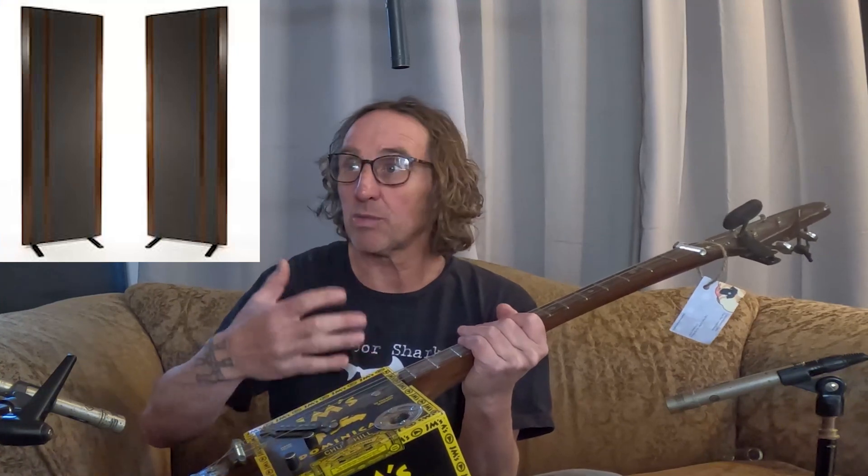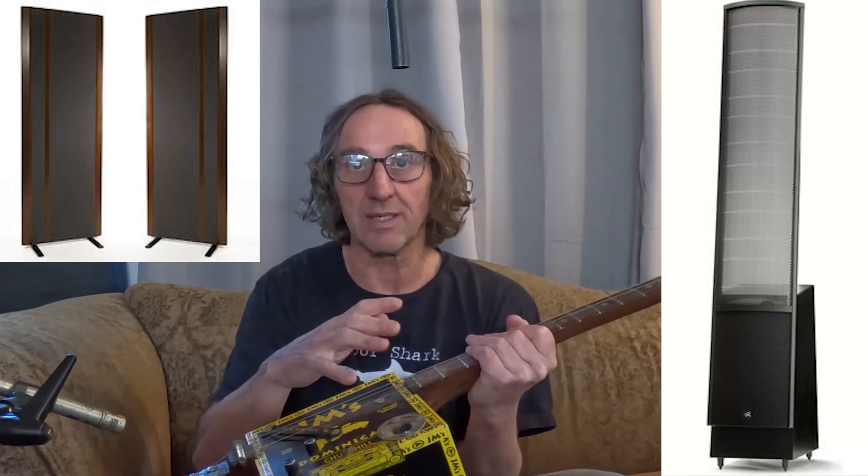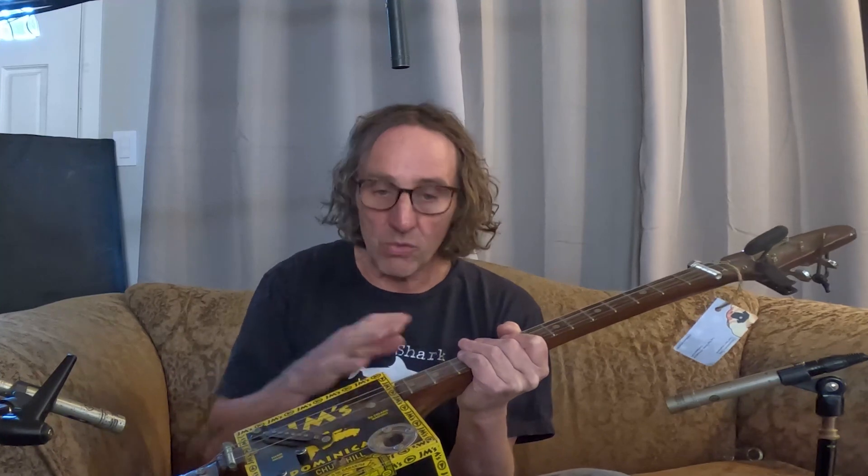There are planar speakers and speakers that radiate at large surfaces, which sound wonderful, and some of these designs are absolutely beautiful sounding — they're just not realistic. They radiate an in-polarity signal out front and an out-of-polarity signal behind, with some cancellation, but again you have the same signal radiated in one or more directions. A conventional speaker radiates sound in one direction — all the sound is pointed one way, and around back it's dead. That's wonderful for keeping sound off the walls and reducing reflections, but it's also not what a realistic instrument does. A real-world instrument radiates sound in all those directions, so a speaker that only radiates in one direction will lack a key aspect of sounding realistic.